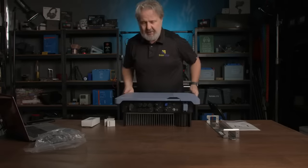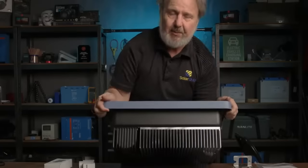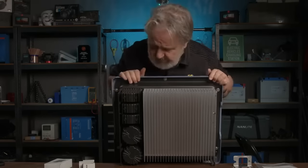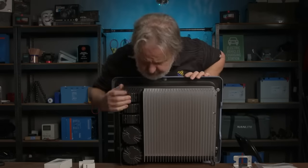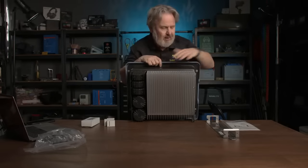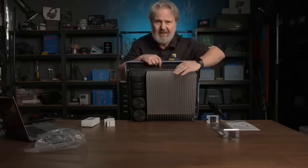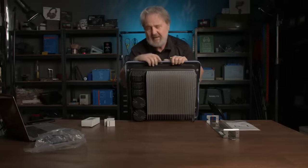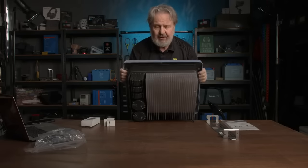Looking at the back — or really the top — you can see the heatsink on this unit is carefully done. It's passively cooled with no fans, so it achieves IP66 without requiring internal cooling. There's a lot of heatsink and some chokes down here. The manufacturer specifies clearances from adjacent equipment, ceiling, or other services, and it's important — this heatsink vents vertically, so it needs space above and below for convection, and some clearance on the sides too. Make sure you comply with the manufacturer's clearance requirements.